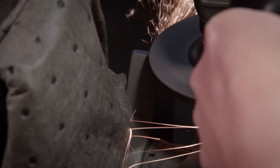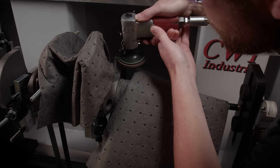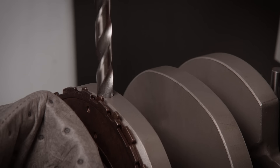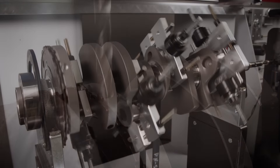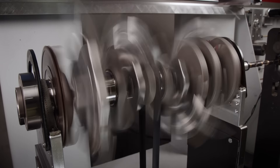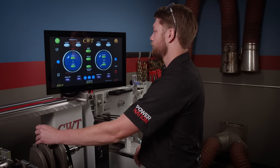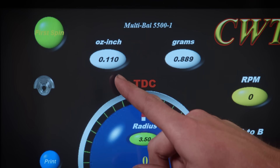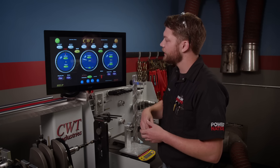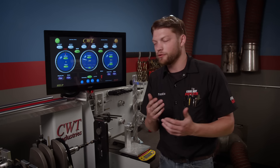For the front, we'll use a grinder to remove most of the material we need from the counterweights and a flap disc to clean up the surface. On the rear, we'll use the drill head mounted to the machine to drill a half-inch hole in the center of the counterweight. We'll go slowly and spin the crankshaft several times until we get it where we want it. The final result: 0.110 ounce-inch on the left, 0.112 on the right, and a force on the center of the crank of 0.061 ounce-inch. That's right what we were looking for.